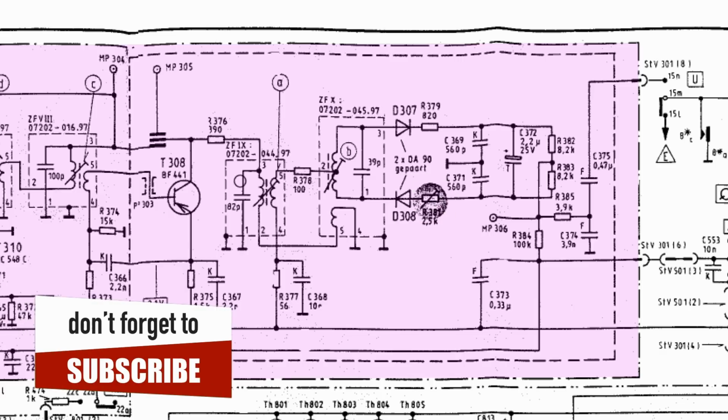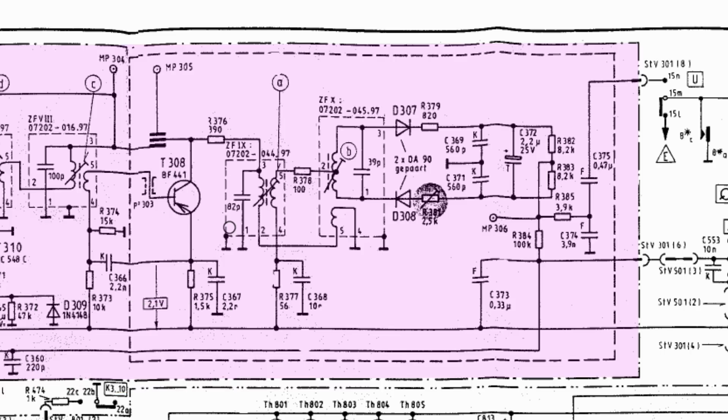And what this means is that if you inject, remember this circuit is only going to pass through 10.7 megahertz carrier. Now that carrier can be amplitude modulated. Normally it's FM modulated. You put a 1 kilohertz tone on it, FM modulated on the carrier. But you can also put a 1 kilohertz AM modulated on the carrier. And the whole idea of this pot is that you test that. You send a 1 kilohertz tone on the carrier, you listen to it at the speaker, and you'll hear it pretty dim, pretty low, or it should be pretty low, nothing like the FM one. And then you adjust this trim pot till you get the smallest amount possible.